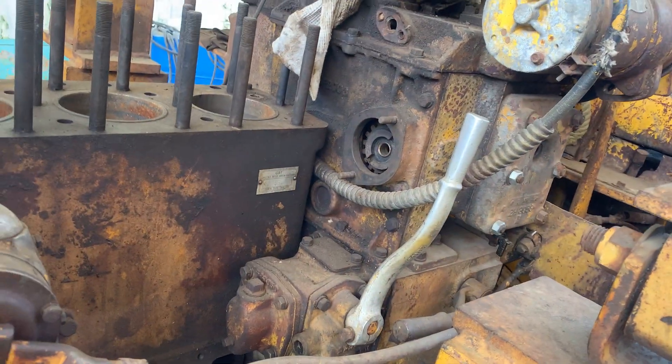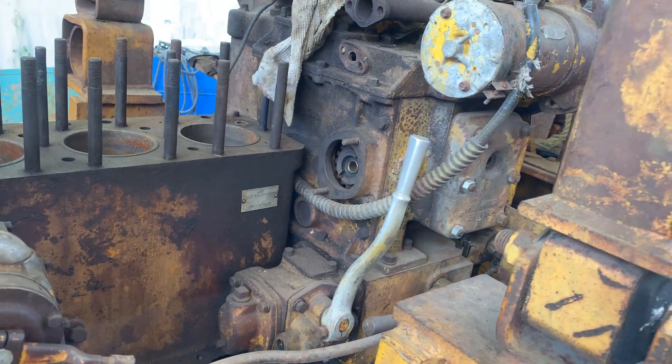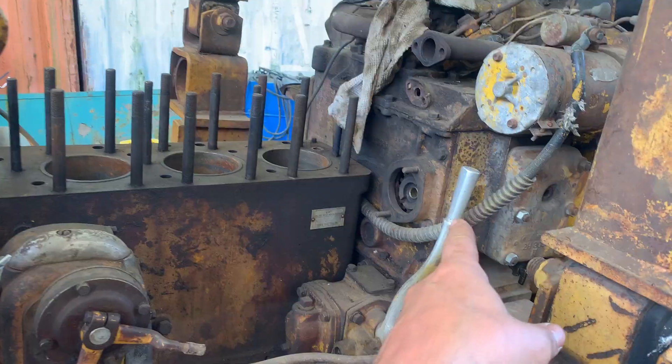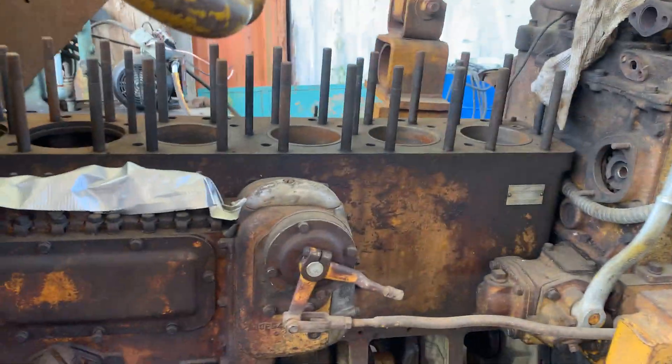It's got the pony motor — and I learned something today, these would be before my time — the exhaust actually goes through the intakes on the head and warms up the big engine with air, and the water from the pony motor circulates through the water in the big engine, so it actually gets a real nice warm-up.